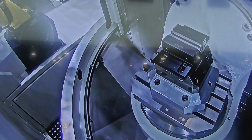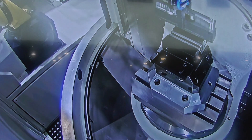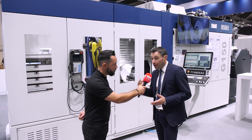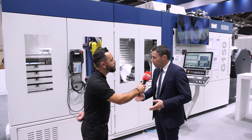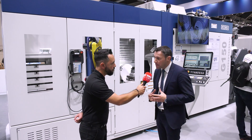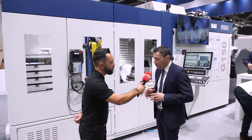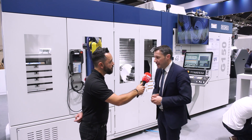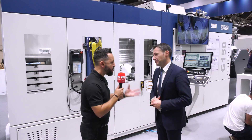The automation can keep the machine busy overnight, over weekends, on shifts, and even on bank holidays. For medical and aerospace components — which can be low volume but repeat frequently — this is absolutely the perfect solution. It works from small batch sizes up to bigger batch sizes. It's a modular system from the G150 up to bigger machines with a loading weight of up to 240 kilograms, and can implement brushing solutions, QR coding, flipping parts from one side to the other — really adding value where you'd normally use on-site labor.